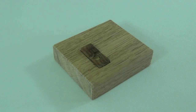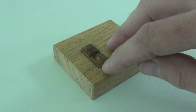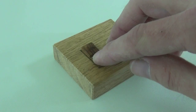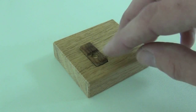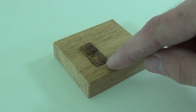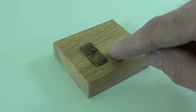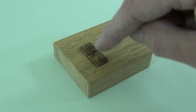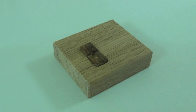I've come up with a little latch to hold the doors shut and to provide a positive back stop for them as well. When the door is pushed against this bevel it springs down, the door can ride over this lower section, hit the back stop, and then because it's sprung up it will hold the door in place. I'm actually going to mount this in the top of the cabinet, and I'll put a solid button whose top surface is level with the bottom of the door down at the bottom, opposing this. That will stop the door being pressed down rather than the spring taking up the slack in the latch.